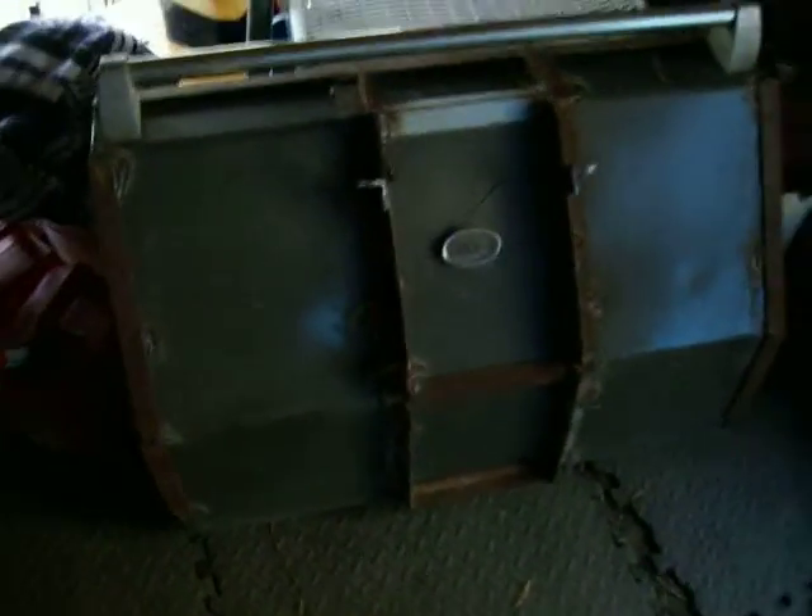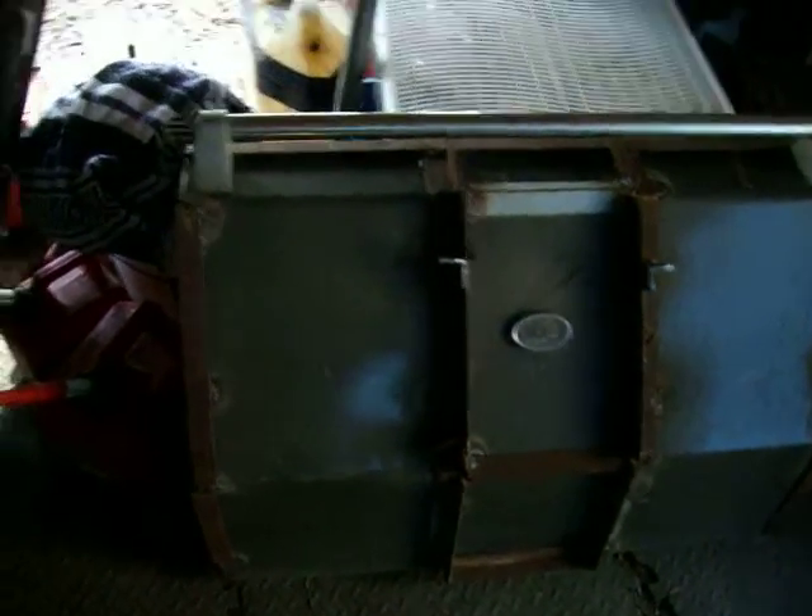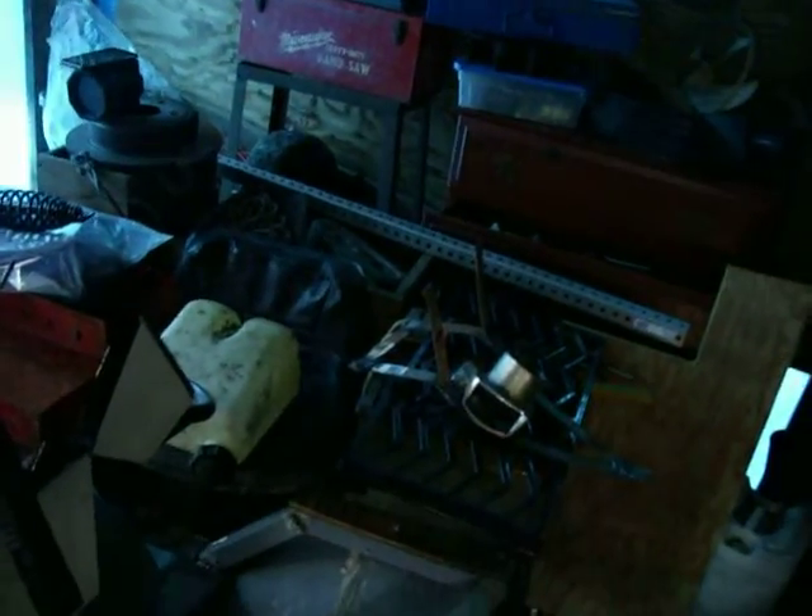I'm hoping I'll hear some good news tomorrow — only time will tell. I've got the front two tabs done for the new bucket mounts. The old mounts just didn't work — I did it wrong and you learn from that. Now it's got two tabs it'll bolt to at the top, and then I'm going to cut two 20-inch sections from that pole, use the existing bolt holes, put pins in them, and they'll go to the bottom of the tractor where the old mower mounts were.